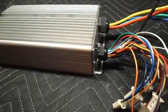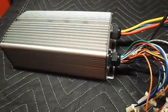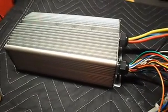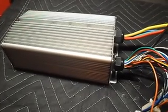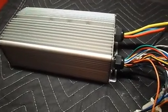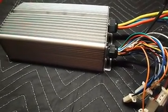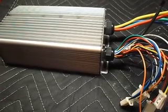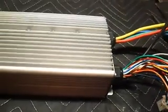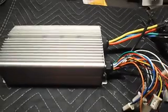A contactor is usually for like the old DC brushed forklifts — the battery went low, or things started getting old and crusty and corroded. Sometimes they would get stuck on and have what they would call a runaway situation where it wouldn't turn off; the power just kept flowing until it ran dead totally. I'm not sure if that's a thing with these brushless controllers and motors, but we still got the inrush — because that would be an issue whether it's brushed or brushless. I'm going to look into this a little bit more.